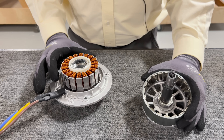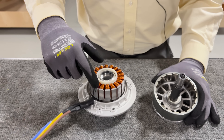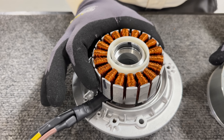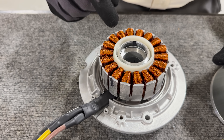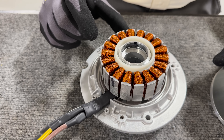Also, this motor was wound with an unusual winding pattern. We've got 18 of these teeth — we call these stator teeth — so there are 18 teeth and 18 slots between the teeth. This is wound using something called a fly winder, where the wire is suspended between two prongs. The prongs spin round and round and two guides move the wire in and out. The fly winder is a relatively inexpensive piece of equipment for winding.